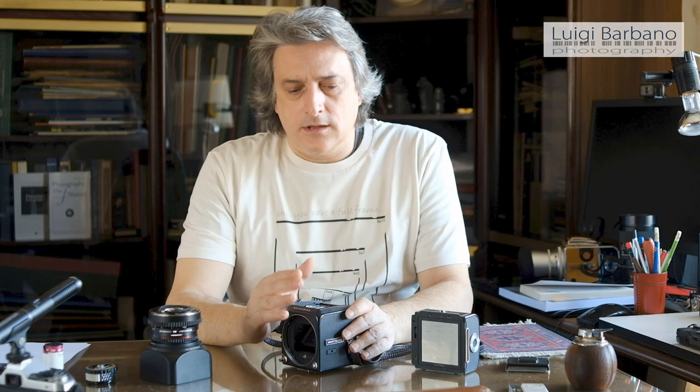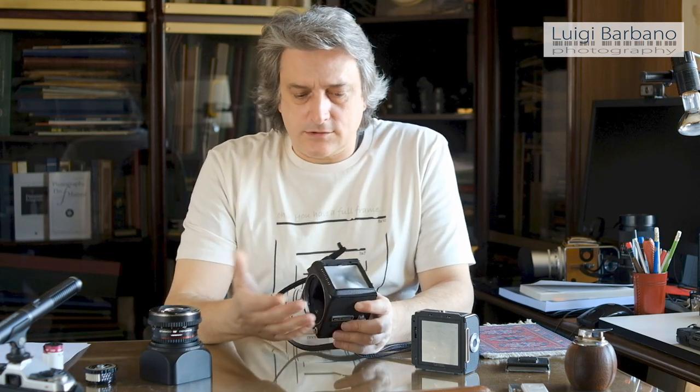So it's a very simple but very precise system. When you buy one, it's worth sending the camera to a Hasselblad service lab and having the camera cleaned and lubricated again. Don't do it yourself unless you are very good at repairing cameras and very precise. The problem I see with these cameras is that lubrication was done in the wrong way — usually too much oil and grease, and often in the wrong places — and it's something that can ruin the camera. You would have to disassemble it to the last screw, clean it up, and reassemble. It's really something expensive in terms of time and effort. So don't do it yourself — just send it to be cleaned. Also, people are tempted because you can find the maintenance manual online, but that's not really something to do if you're not really experienced.